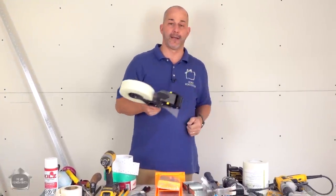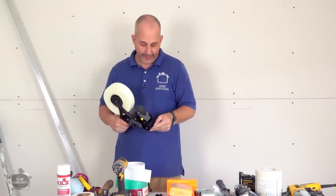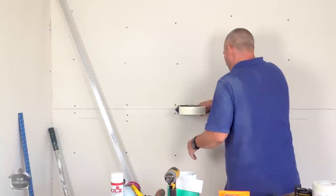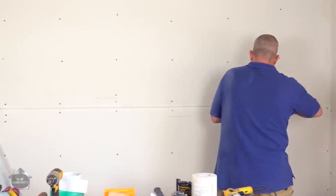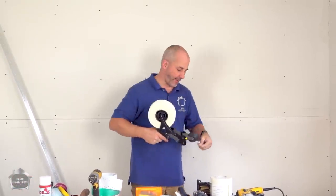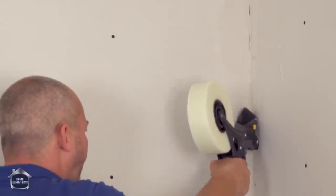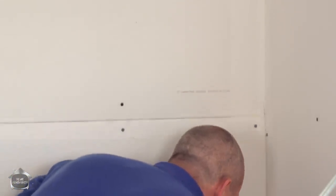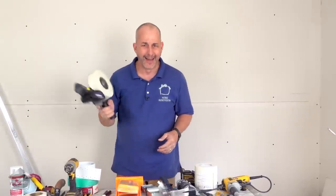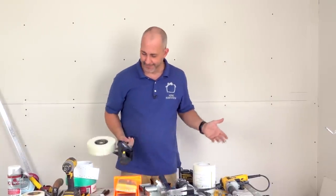You don't have to just pull tape off the roll — there's a great little two-in-one applicator for fiberglass mesh. You start it on a roller, press it into the wall, and run down to the corner. You can also pop the wheel out and use it to apply mesh tape directly into a corner. For anyone saying you can't use mesh in the corner — they literally made this tool because you can. Just make sure you use the right mud with it.